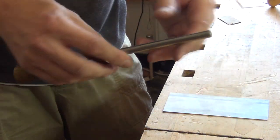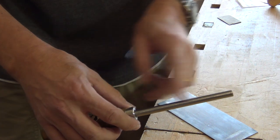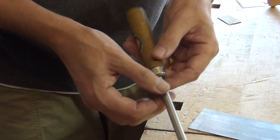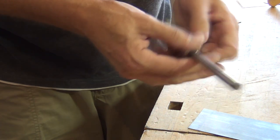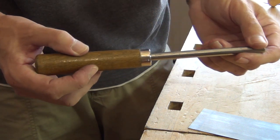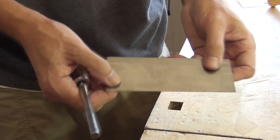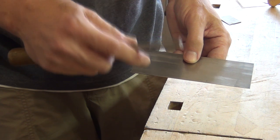We traditionally use a burnisher — this one is from Germany by Kirschen. It's a hardened tool steel rod that should be harder than the scraper. Card scrapers today are being sold that are much harder than burnishers, so what happens is your burnisher ends up getting scratches on it. What I do quite regularly is chuck it up in my lathe and use very fine sandpaper just to polish it back to a nice smooth surface. This is important because if you have bad irregularities on the burnisher, that will impart problems with the burr, and the roughness will show up in the work. You can get carbide ones these days which are lovely and hard — that's probably the route to go down.